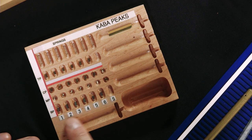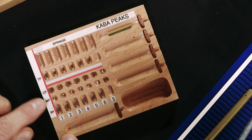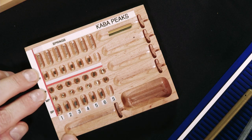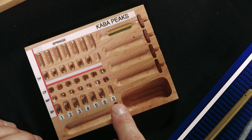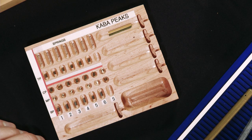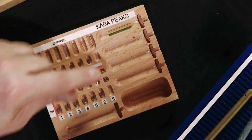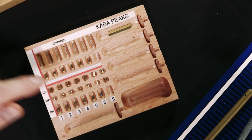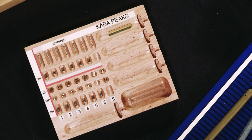As you can see, we have the bottom pins in a row, 1 through 6. The master pin and where it says CP for control pin and top pin are both going to be the top pin split for this particular cylinder. We have the patented pin chamber here where it says S. The bottom pin, as you know, is already installed by the factory into the cylinder. We just need to add the top patented pin and a 7B to fill up the remainder of the space. Here are the springs, and over here is the spring cover that we'll be using.